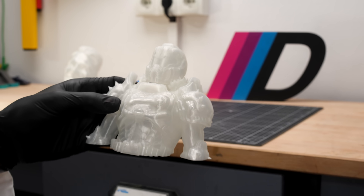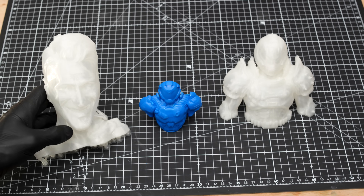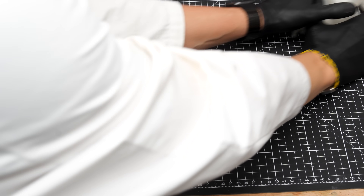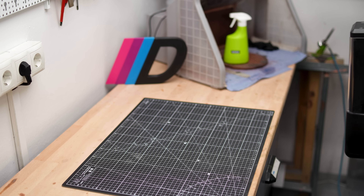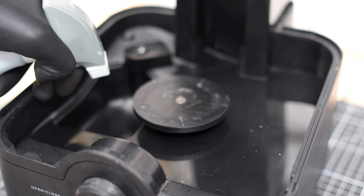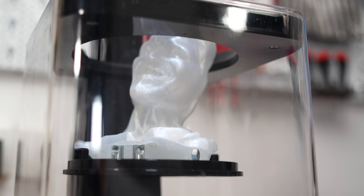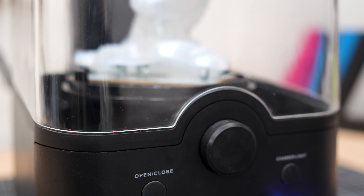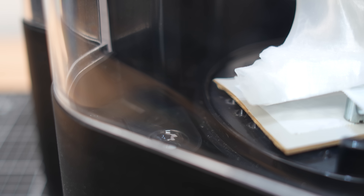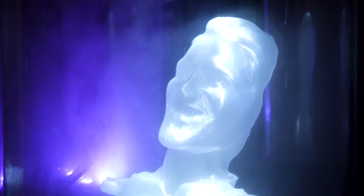Now we've got all these awesome prints ready to go. Before we start electroplating, the PVB prints can still be smoothed with IPA. You can either spray it on and wait, or you can use a vapor polishing machine like this one. Just fill it with isopropanol and then try to get the print inside. It's fully automated and painfully slow, but the machine does exactly what it's supposed to do — it smooths the print beautifully. Perfect prep for the clean metal finish.